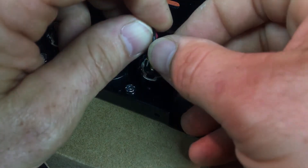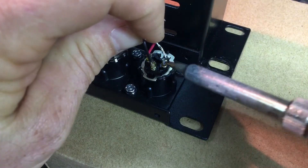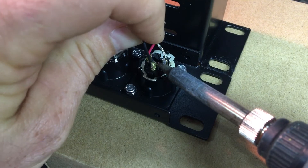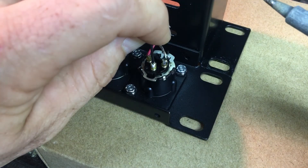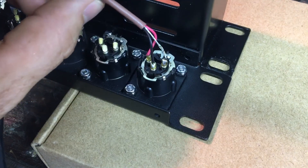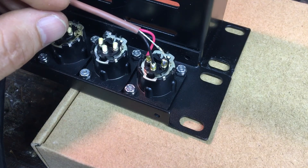I get my little bend strategy going so that I'm able to push this wire into the molten solder. What I don't want is the wire touching the cup while the cup is heating up. It's wet — I push it in, and it is cooled off. And that is an XLR cup. There's a lot specific to an XLR, but there's also a lot of principles here that are just general soldering. Hope you guys enjoyed it.